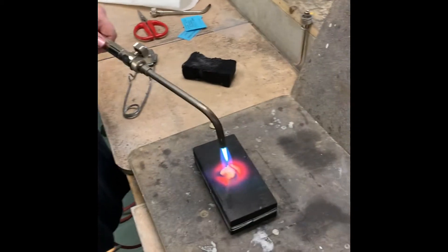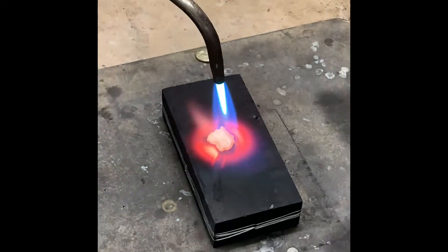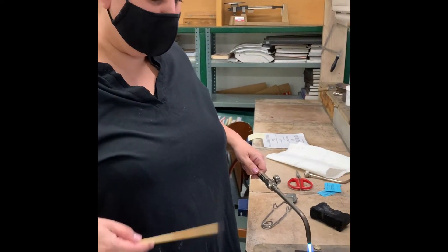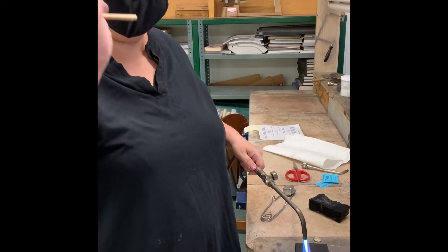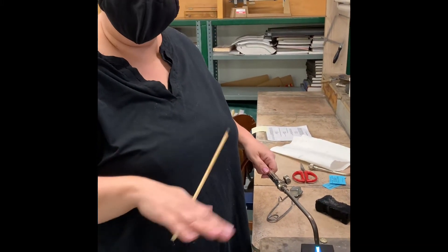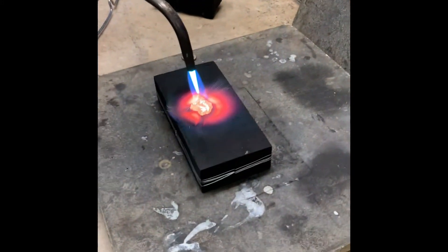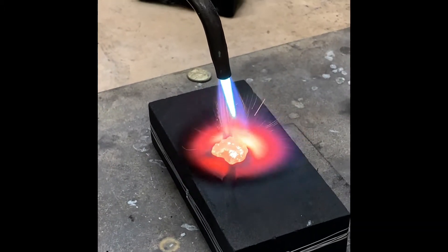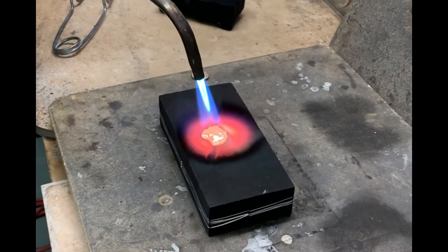Can you repeat how it doesn't need to be too deep? A common problem is people dig their charcoal blocks too deep. It's actually surprisingly hard to get your gold hot enough if you make it deep, especially if you make it deep and straight up and down. Mine are usually much more broad and shallow with kind of an angle coming out, and it heats a lot faster. We've got gold in the hopper.